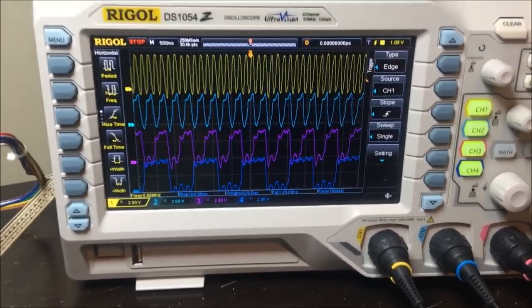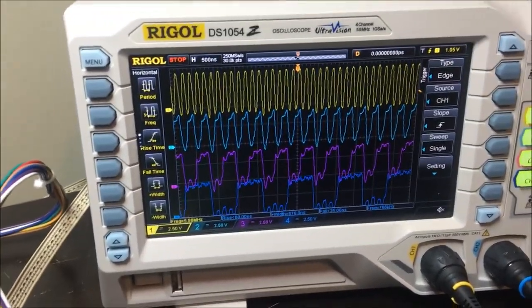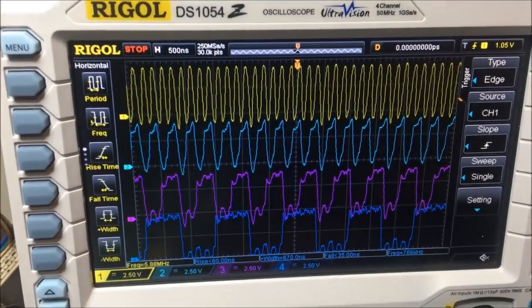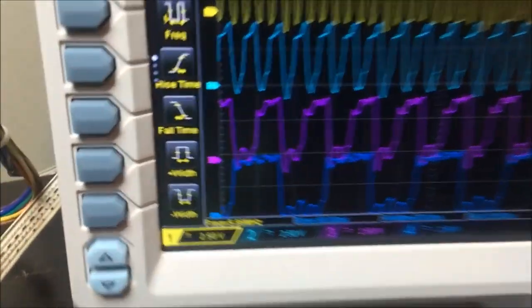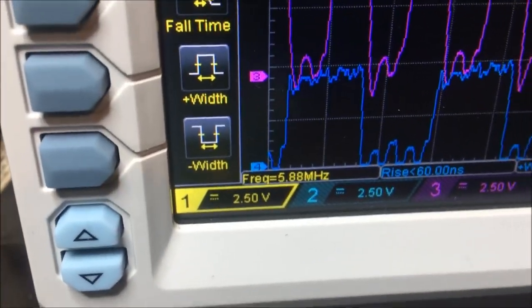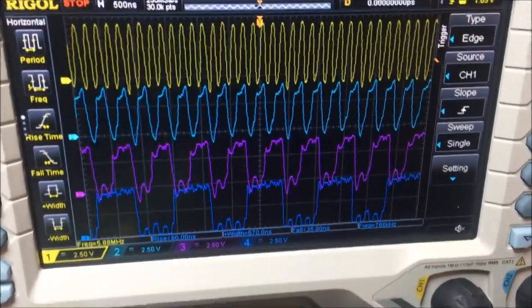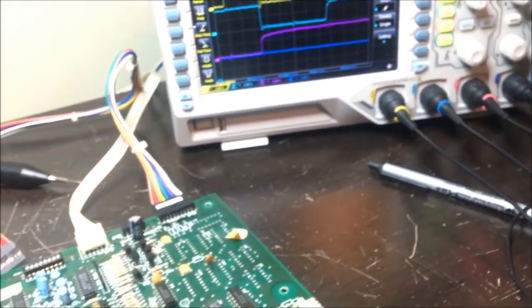I just wanted to really quick show how the horizontal and vertical signals are created. It's kind of cool like this. This is the first stage of the horizontal count. Up on top there, that's 6 megahertz. 6 megahertz goes in, and that's what gets divided out. And then it goes to the next one. So I'll just move it over to the next and hit sample it.